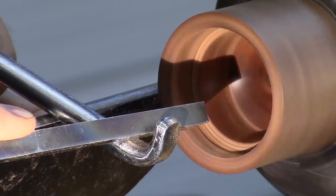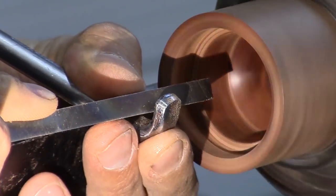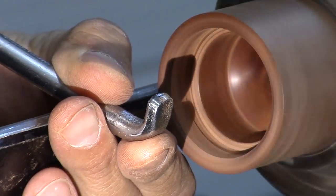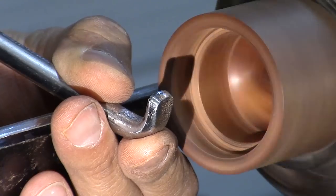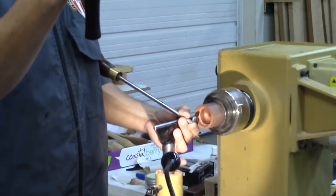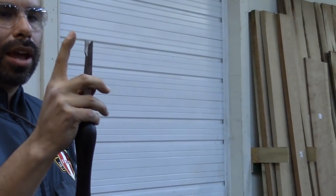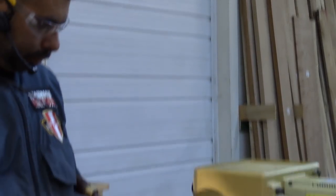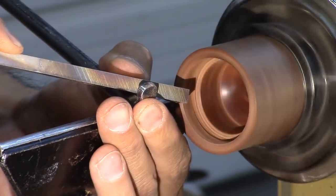Now remember, you have to be very delicate with the threads, entering the threads. You don't have to push it. This chaser was just sharpened. I bought a sharpener, so it should just go through. It grabs on the first teeth, and it should follow the next ones. The first teeth is the most important one. It can be damaged, it can be unsharpened. The first teeth does all the trick. So I will enter this, first of all, on an angle, on the chamfer that I just made.